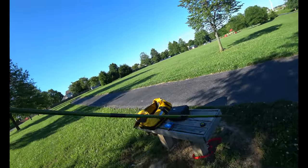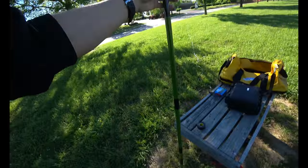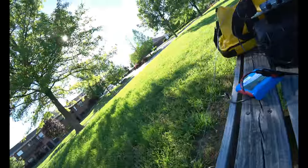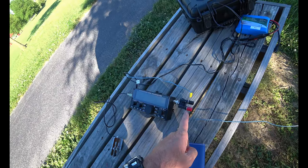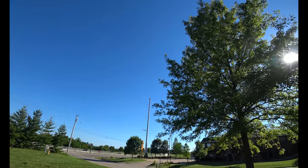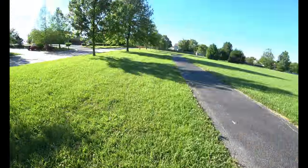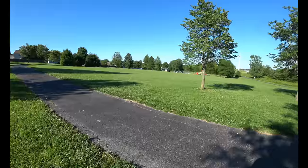The biggest problem I have to solve is how to force this to stay up when there's nothing else around. I don't want to spend time doing guy wires. Here's the summary. I've got this BNC splitter, I don't know what you call it. So basically, I've got the radiating element going up to the telescopic fishing pole. Not very high. I have 21 feet of wire. I've got the counterpoise going on the ground that way. I would go that way in opposition to the antenna, but of course someone will walk by there.